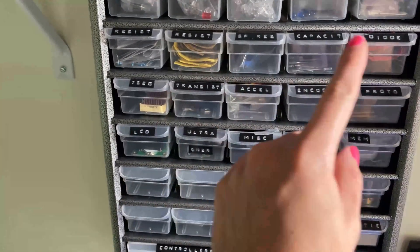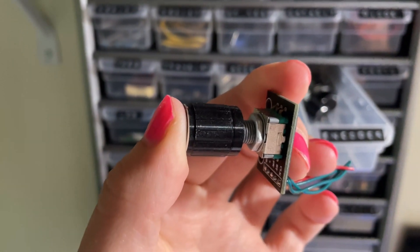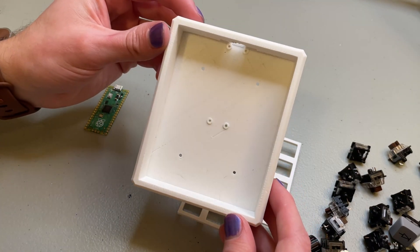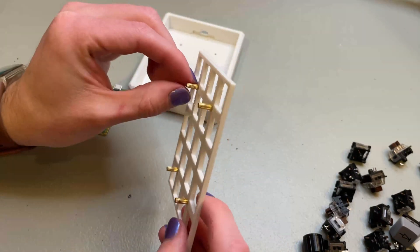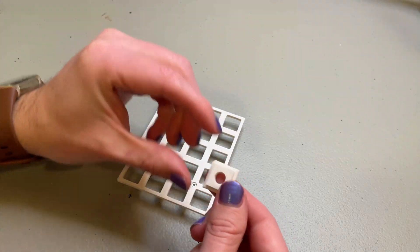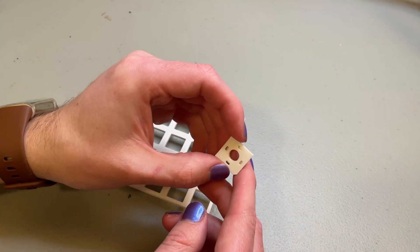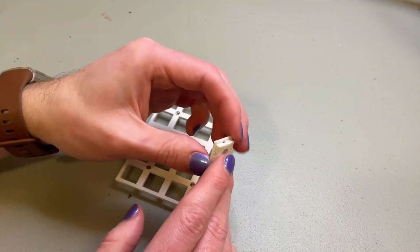To do this modification, you will obviously need an encoder. I'm going to use one that I got on a breakout board — I removed it from the breakout board using a solder sucker and a lot of patience. This encoder does have a click feature, like a button. I did end up designing and printing a new case for my number pad because the plastic threads on my original are starting to wear out. This new one uses brass standoffs, so those threads should last forever. I've uploaded the new case and plate if you want to use it. I have also added an adapter piece so that you don't have to print a whole new case — just install the encoder in the adapter and install the adapter in place. This adapter should work for any of my keyboard designs and most keyboard designs for MX switches, as long as the hole is about 14mm square.